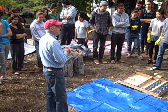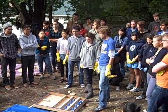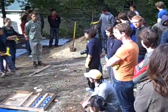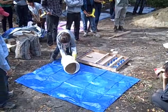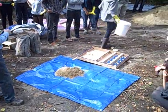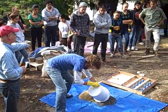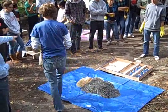Let's start with two shovels of cement, four of sand, and eight of stone. Let's try that and see where you end up with a mountain here. We've got three shovels, so one person can do the cement, one person can do the sand, and one person can do the stone. Two shovels full of cement. Eight shovels of stone — that's going to be the maximum we can do, for sure. Half a bucket is four, so that's a good measure if you want to do it that way.